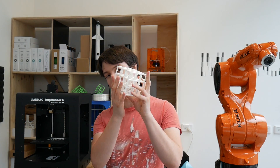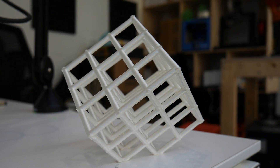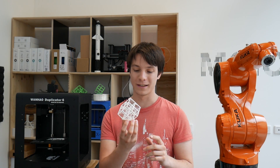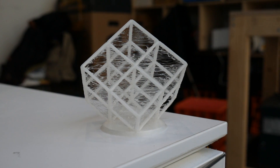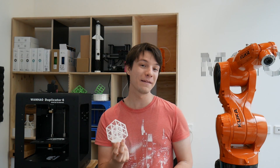I started with the Lattice Cube, printed in Poly Alchemy Elixir Natural Blend PLA. It's okay at face value, but looking closer, the undersides of the rods are very rough and droopy. I then switched to the natural PLA that came with the Wanhao — no colorants added. The result was my torture cube with stringing up the wazoo. A nuts amount of stringing, even with retraction enabled, probably not nearly enough. The temperature may have been too high. It all comes down to cooling.